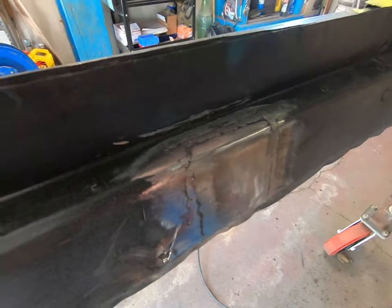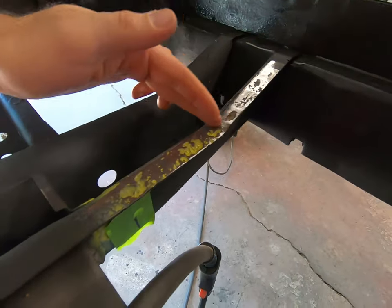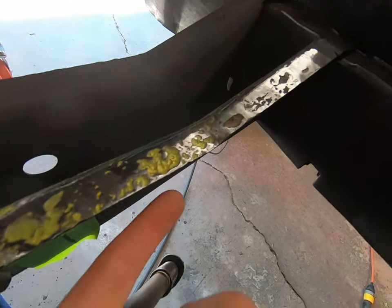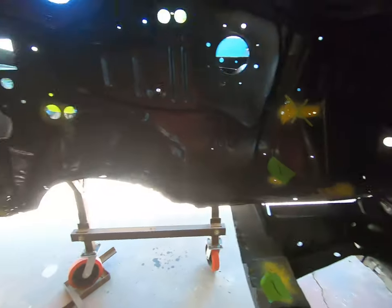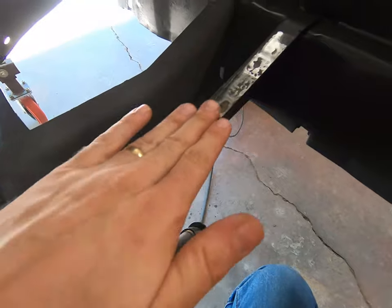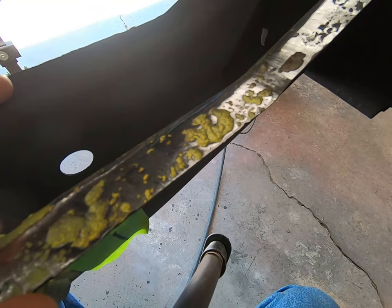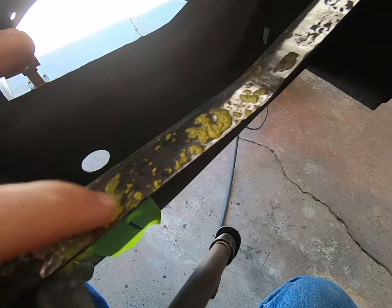While I'm here I went ahead and buzzed this lip off from the frame rail — this is the torsion bar crossmember. There's actually a small pinhole right there. I had sprayed yellow on all the areas that are bad just to highlight for the viewer what needs done. I went ahead and shaved it down, and once you hit bare metal you can burn the paint out of it. I want to go in and basically fill all this up — fill the craters directly, don't pile it up, and then we can go through and smooth it back out.